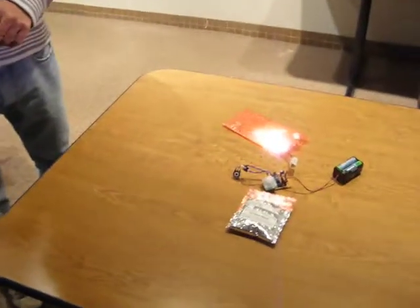When you build a project like this, there are many things you can think of to improve. First, we could use a variety of other sensors to detect motion more effectively. We could also pick up more cost-effective sensors. Because we used a passive PIR module, if we had a chance to do it again, we'd probably just buy the sensor alone and implement it using our own circuitry. In that way, we could reduce the cost by about 10 to 20 percent.